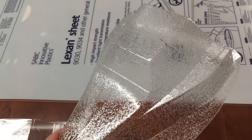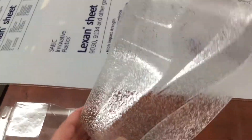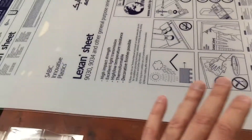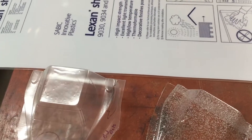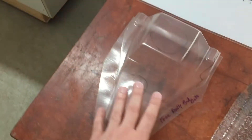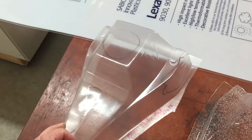Ultimately this video is just to show you why it's important to dry polycarbonate — if you don't, you get terrible looking bodies. Some other plastics like acrylic are brittle and don't need drying, but ABS and polycarbonate must be dried before running or you risk these defects. After drying, once you take the plastic out it immediately starts re-absorbing moisture; you probably have a couple of hours before you start to notice spots, but after a few hours you'll need to re-dry it. So we go right from the oven into the machine.